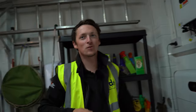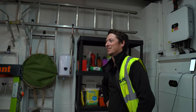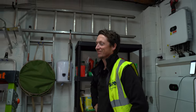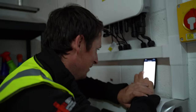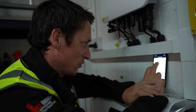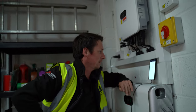We've got 0.26 kilowatts of generation on a 3.5 kilowatt string — it's cloudy out there, that'd be why. This is what we see on the engineer's side: 0.256 kilowatts of generation. The battery is also helping the house because the house is generally drawing about 500 watts at the moment — that's all looking good.